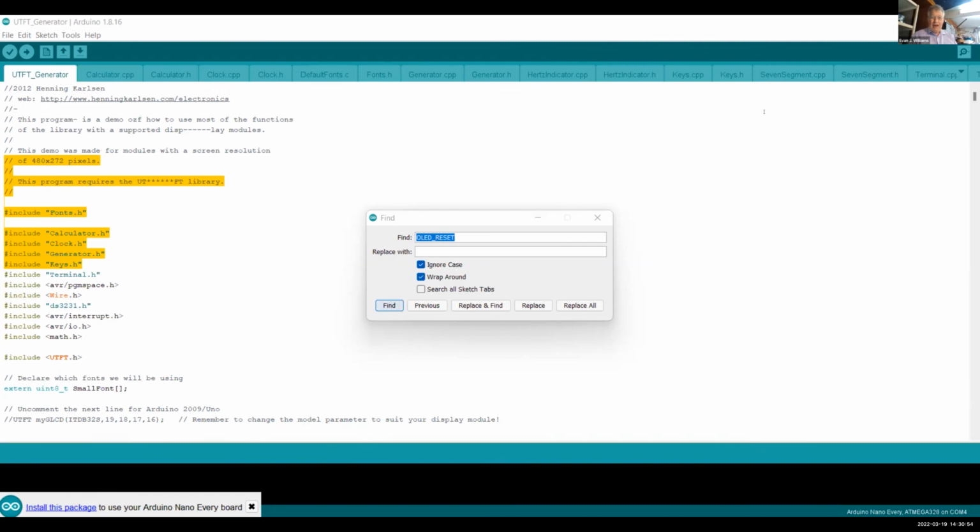So you can really go quite far on Raspberry Pi, but that's using an operating system. Something like the Texas Instruments boards, or Red Pitaya, or the Texas Instruments MSP430, are giving you a better real-time clock and better analog to digital. They're not programmable compatible with Arduino, but it still is C++, and there are some good resources there.